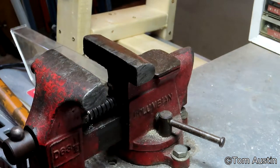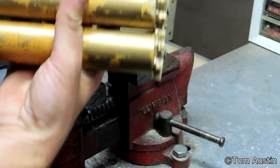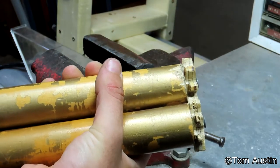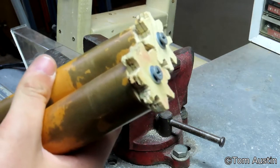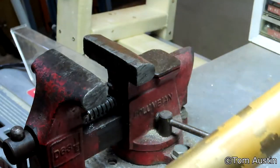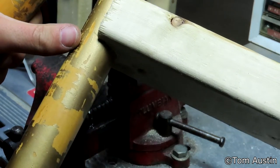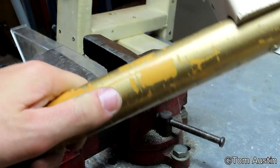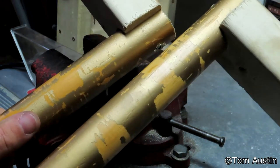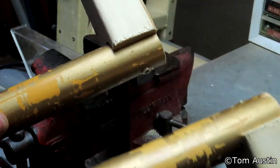There's my second roller — as you can see they do in fact interlink, but there's going to be a lot of fitting involved. At this point, do the final fitting to make sure your gears are interlinking correctly. Then remove one of your arms and cut the remainder off so the rollers don't interfere with each other. If you put the arm on the outside, you actually don't have to cut the roller at all — that's an advantage worth considering.